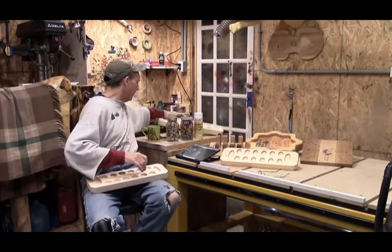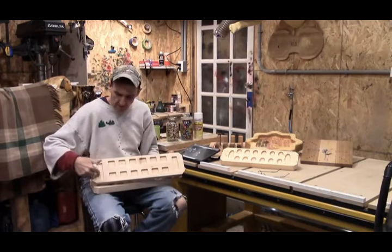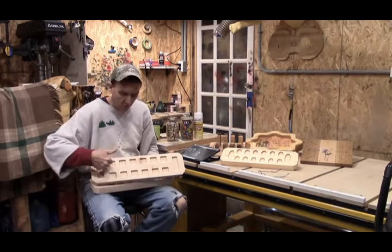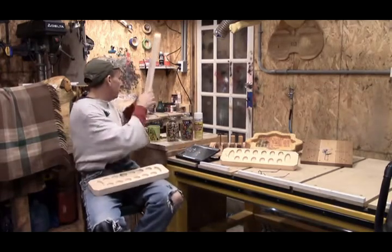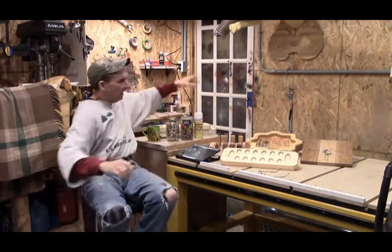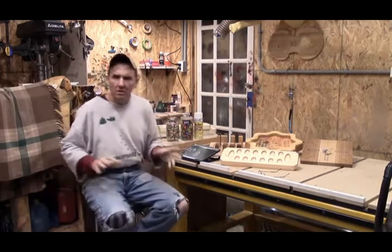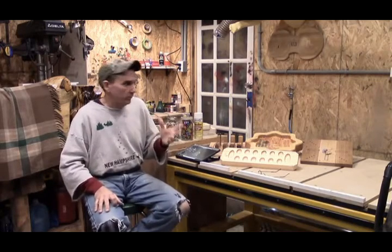The third board we gave you, set for a 2x6, was a radius rectangle with 12 square holes. So you've got square, round, and obround options. These literally mill in a matter of minutes — I was able to do all three in 20 to 30 minutes with one quarter-inch end mill.